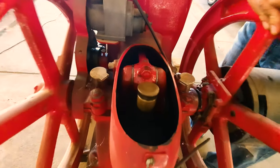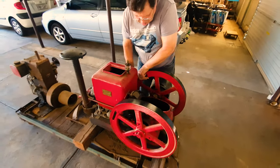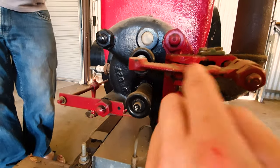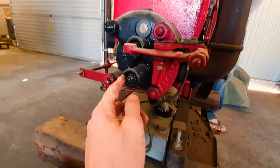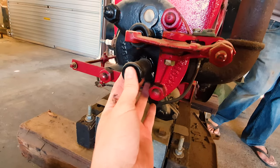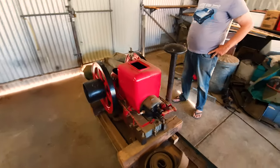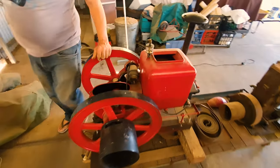It's something we wanted to do because Grandad, when he was on the farm and came to Australia from Poland, was one of the only few people who actually knew how to operate this engine and could get it running. Now the reason why is because it's called a hit and miss engine — the exhaust valve is controlled by a camshaft and a push rod, but the inlet valve is purely operated by the air vacuum of the cylinder drawing the spring in, so it only draws in enough air and creates enough combustion when it really needs to. So it fires and then may tick over without firing for a couple of revolutions and then it'll decide to fire again.